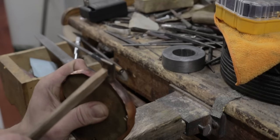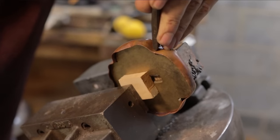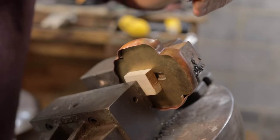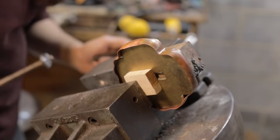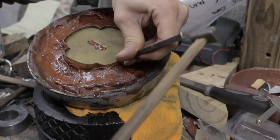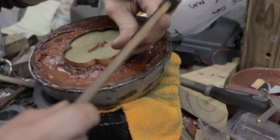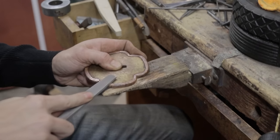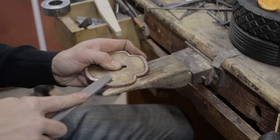After that, I squeeze the tsuba inside of it and punch in the corners, thereby trapping it. Once the corners are punched in, like that, I start working the entire rim until the tsuba is trapped. At this stage, it's relatively loose inside, and the reason is, as you work the copper, it conforms and tries to escape any tension. So I have to continuously work on the tsuba, including setting it in the pitch pot, in order to make the copper rim fairly tight and even.